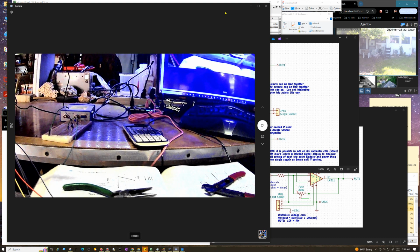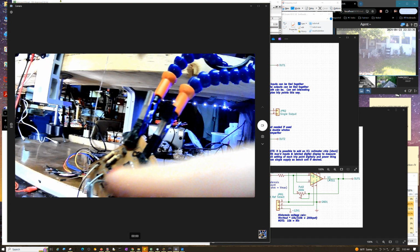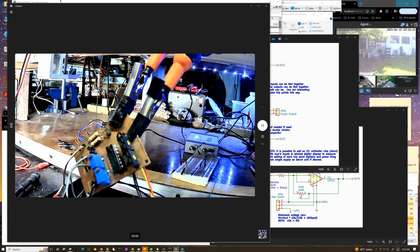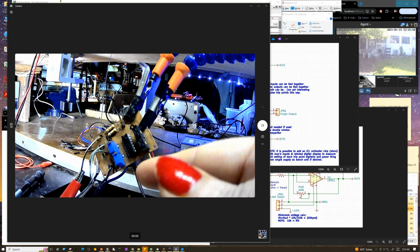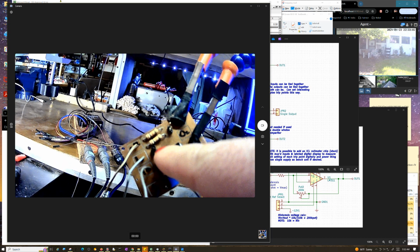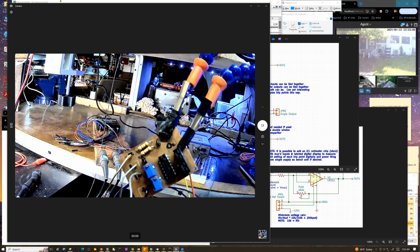But at any rate, it's an interesting little window comparator, and like I said, I have a couple of different pots. These two adjust one channel, where they're multi-turn, so you can do it precisely, whereas these are just the regular single-turn pots. But again, this would allow you to have either 2 independent window comparators, or to combine them like I did here, because I have that little jumper right there, and that's what makes them act like a single input to both comparator sets.